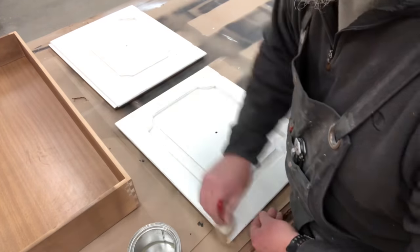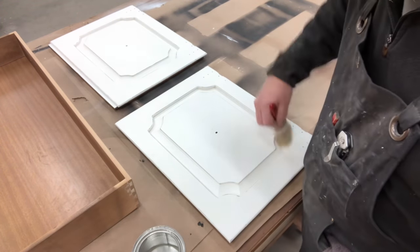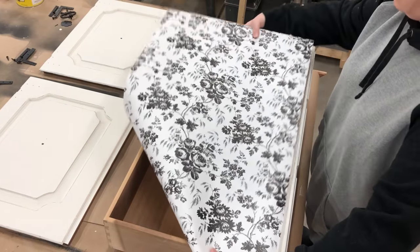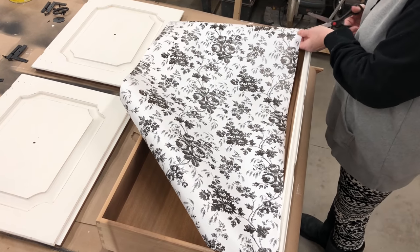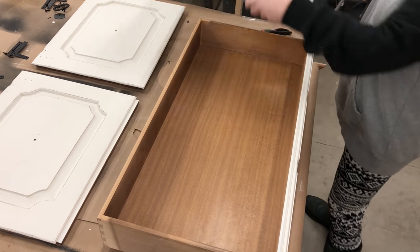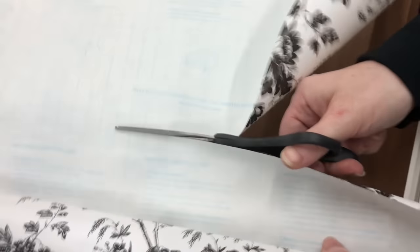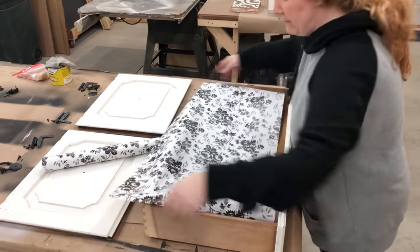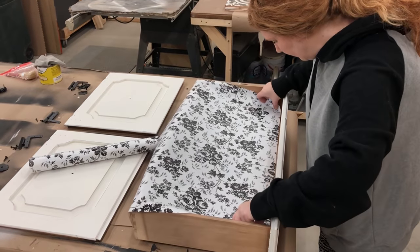To finish these three pieces and give another level of protection on the white paint, he's going in with Varathane Finishing Wax, using a waxing brush to put it on and then wiping off any excess. Then I will go in with some black and white contact paper that I get at the dollar store — you can also buy it on Amazon, and I link it in my description. I absolutely love this little hidden pop of detail. It makes the drawer feel brand new, even though it's a thrifted flipped item. I try to share this technique on every piece of furniture we do.